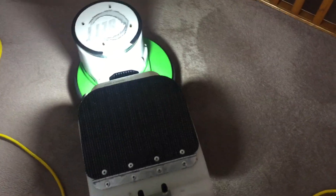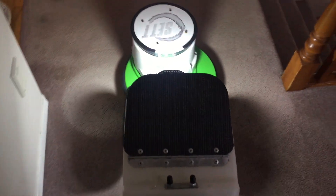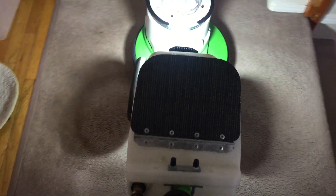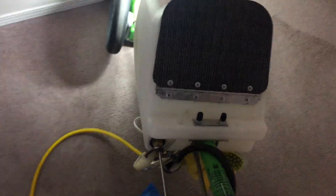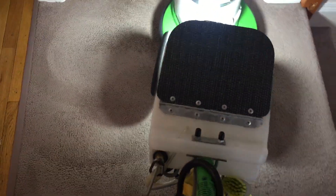We'll head over to this area — it's the most worn and soiled area, right at the top of the stairs and into the entrance into the kitchen. Applying a little bit heavier here. I don't need to get crazy with applying solution, just make sure there's enough to emulsify the soil. I certainly don't want to wash anything into the backing of the carpet — just enough moisture and solution to do the job and get the fiber pad really scrubbing those yarns to lift and separate the soil from the carpet fiber.